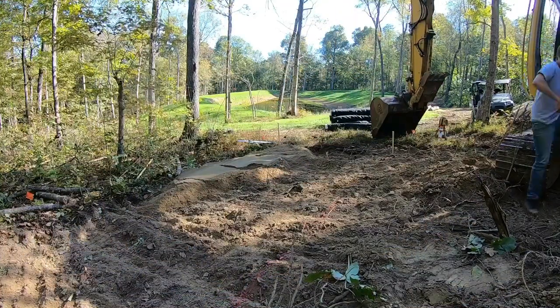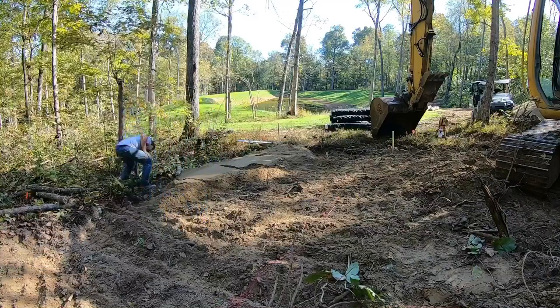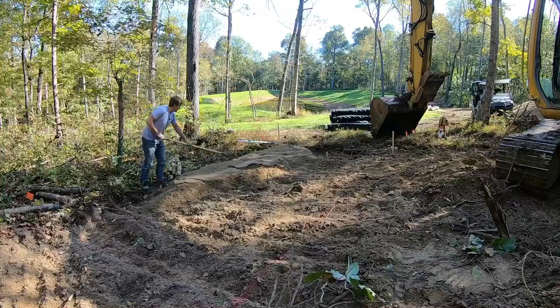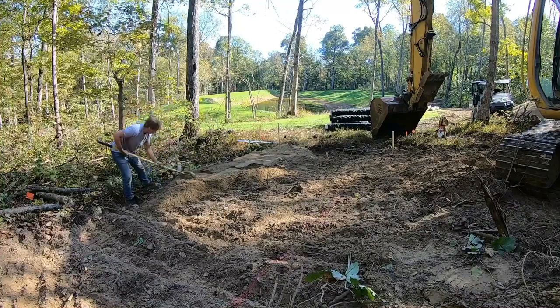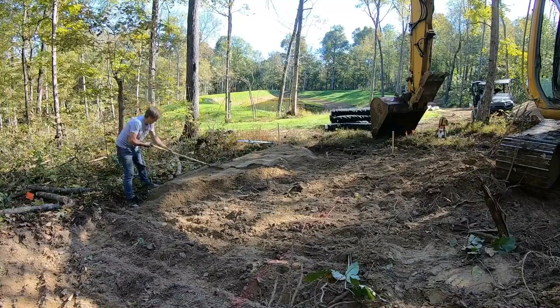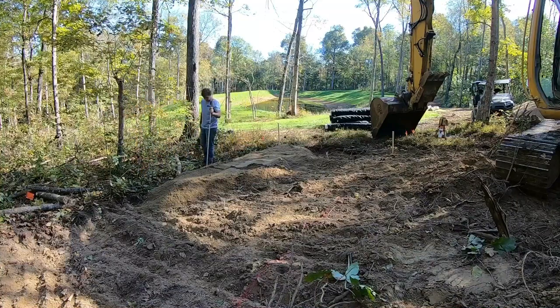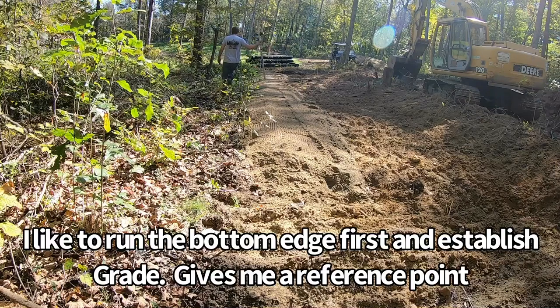Now, sometimes you get lucky in our area. You might be able to put in chambers, which is a very less expensive option. But if your soil is good, just as effective. But unfortunately, because of our heavy clay content and very shallow limiting layer, these sand systems are kind of becoming the way to go. The state makes it more and more strict each year. And I can only imagine from here on out, they get even more expensive.